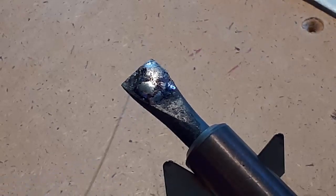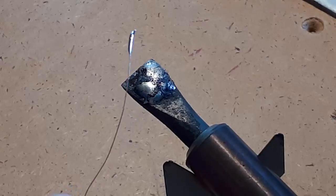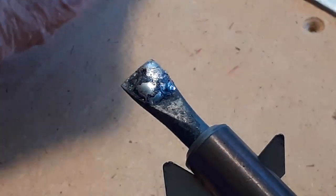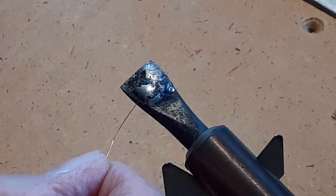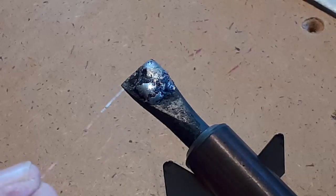What you're looking at is an old 100-watt soldering iron with a flat blade tip. I let that get very hot and put a blob of solder on the end of the tip. This soldering iron is used just for this — that solder stays there. All I have to do now is insert the magnet wire in that blob of solder, and it comes out extremely clean. You can do this over and over with that blob.